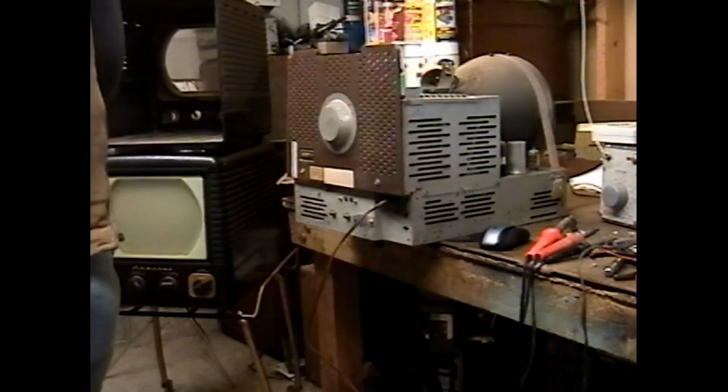Okay, so I looked up the rider's manual for this set on the Early Television Museum's website, earlytelevision.org. For monochrome sets like this, go into post-war television sets, and then into technical information, and then pick your brand and your model, and they probably have the service information, although there's plenty of stuff that they don't have service information for. Vertical output tubes, this 12AU7.